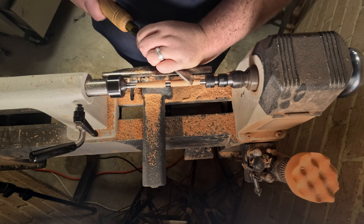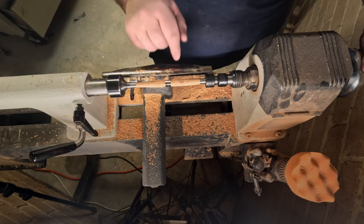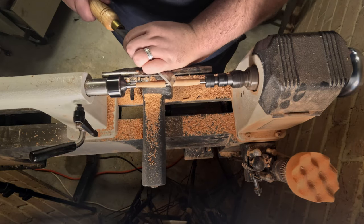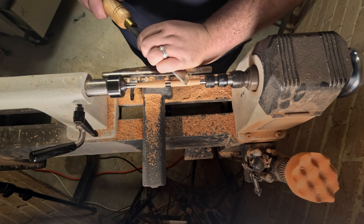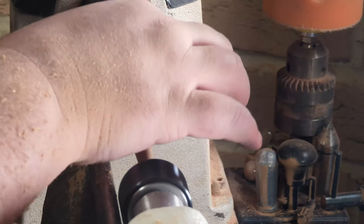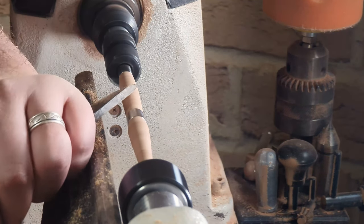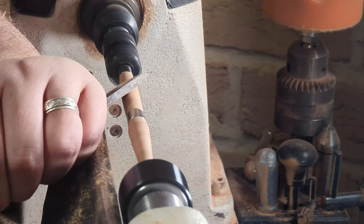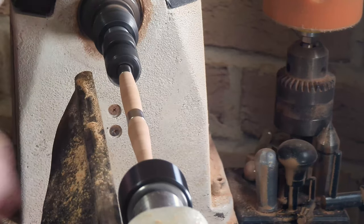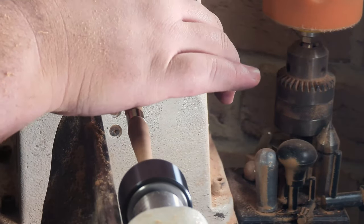Just making sure I hadn't chipped out any of the ends of the tubes and continuing on. I'm not far away from starting to sand now. There's a little bit of chip out on that far end. I'm just having a feel, seeing how many ridges I've got and I'm liking this finish coming off the skew. Compared to the roughing gouge, I found my sanding on this was extremely less and the finish on it also came out much nicer.